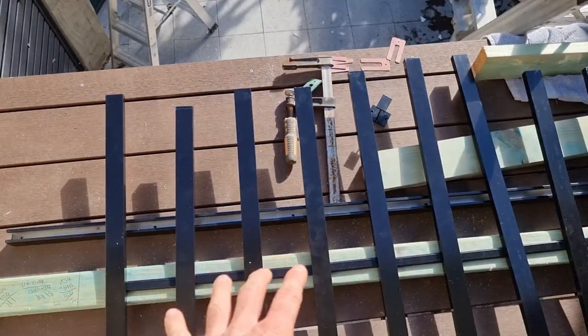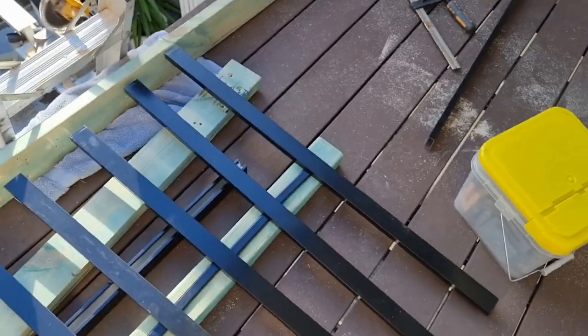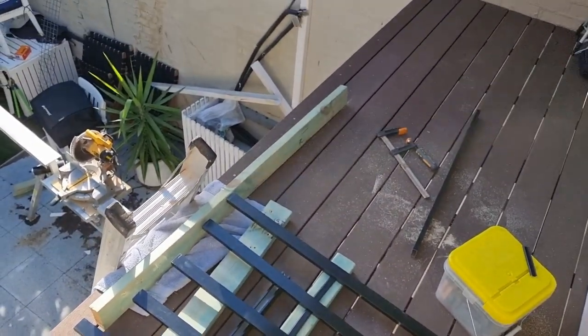Just as a triple check, since I've never done this system before, I ended up measuring 57mm down there — it will end up being 60 once I'm fully square. Even if it's 57 or 58, it won't really matter because it will still look nice and even. That's how I work out my spacings for the balustrade.